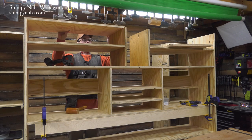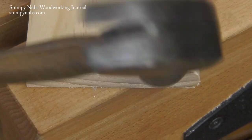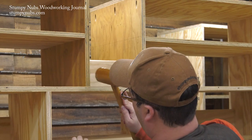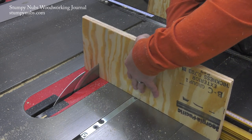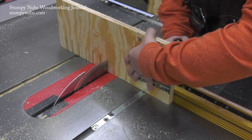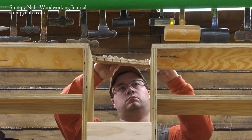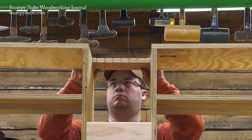Another thing I'm noticing is this sucker is a lot bigger than it looked on the computer screen, which of course means I should invest in bigger screens. Here's a pro tip: why use a block plane to create a chamfer when you can beat the bevel into the edge with a hammer? The chamfer was only there so I could force this piece into place — it was pretty tight. At some point every woodworker will say those nine magic words: 'I need a bunch of fingers in this board.' I'm using plywood instead of solid wood because the alternating grain will prevent these fingers from splitting off over time, and because I have a bunch of scraps on the floor. I also used a larger piece than needed so I could support it on the miter gauge during the cuts and then trim off the excess. As I put this little guy in place, I bet you can guess why I made that gap in the shelves — I won't spoil the suspense. We're having too much fun, am I right?